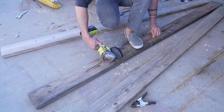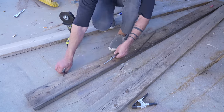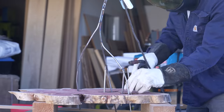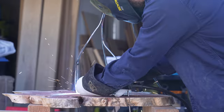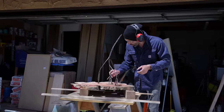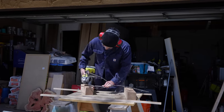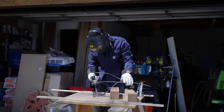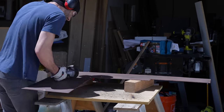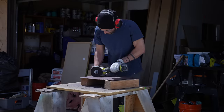I cut some short pieces of rod, and once I had the general structure of the legs in place I started to tack weld on these smaller pieces so that they'd really spread out and fill in the holes. I'm using scrap steel — the tin and bismuth alloy isn't that cheap — so I want to use as much steel as possible to reduce the amount of alloy I need. For the base I just cut out an organic shape out of some scrap plate steel.